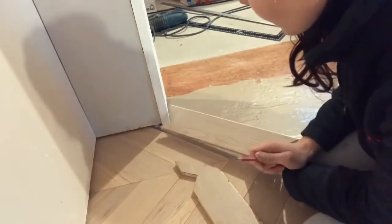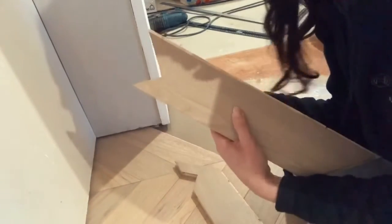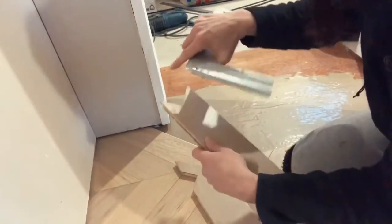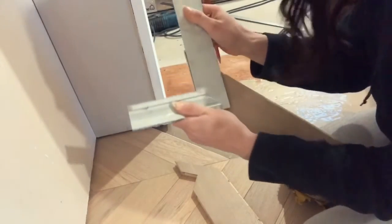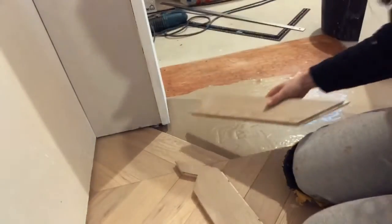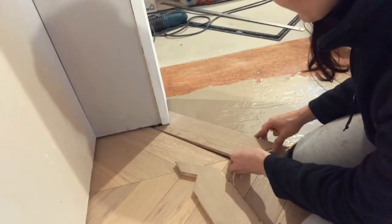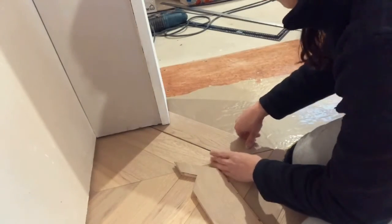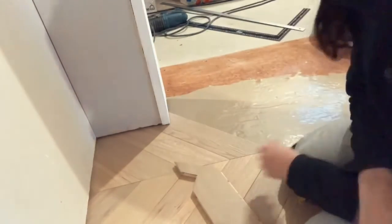I think it was about 4 centimetres. And then the wall is a right angle, so I just used a square. So I got the one angle, so I took that angle, popped the square on and cut it to the end, and that then slots in. It's really important to have the boards in place when you're measuring up, because you need something to measure off. If you just try and measure before anything's there, you'll struggle, but no problem at all.